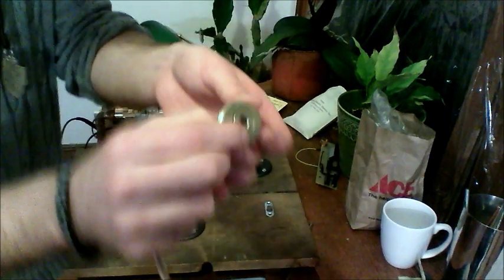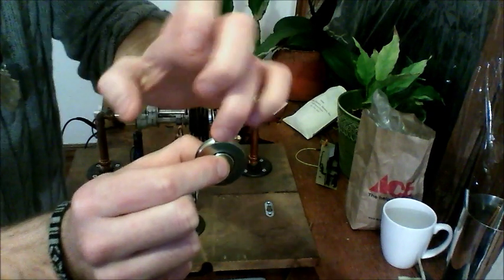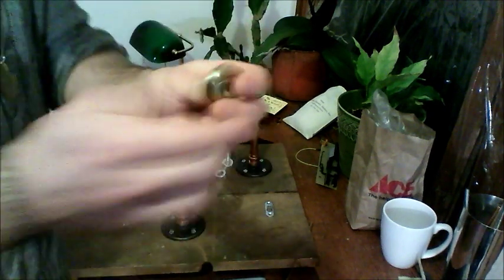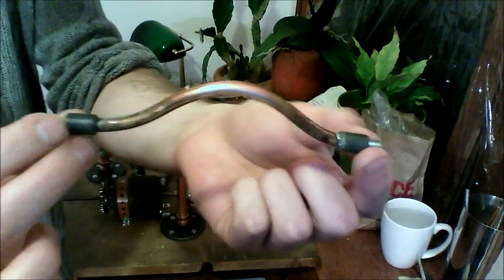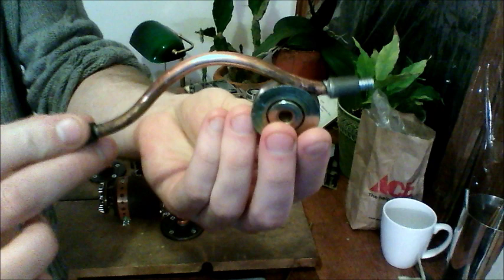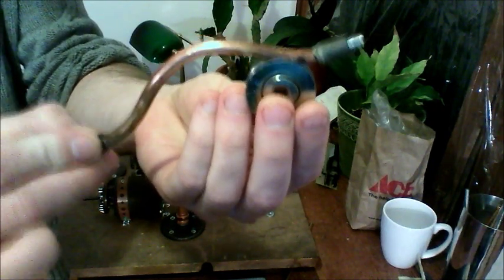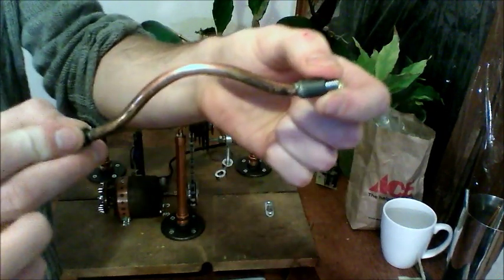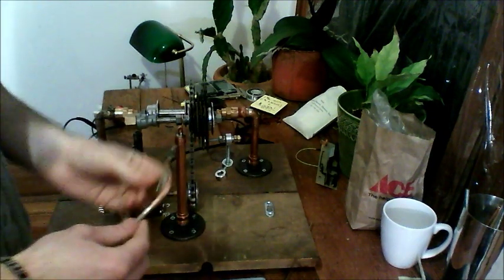But the friction of the pulley that I got spinning was greater than the friction between the top of the pulley and this copper, which was supposed to be pushing it up, so that was one problem. Another problem was getting this piece of bent copper pipe to have the ends perfectly parallel. Also, when this would shift over here, this side would want to be heavier, and it would pivot on top of that and get stuck on the posts it was supposed to be riding up and down on, so that idea had to be scrapped.